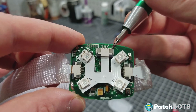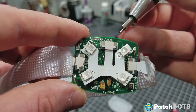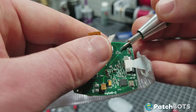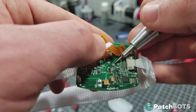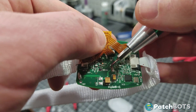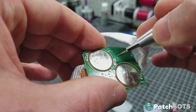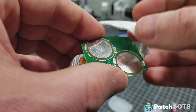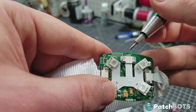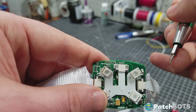Here's the main terminal for the NeoPixels. There are four pins labeled 1 through 4. If we trace off the fourth one, we can see it's a path on the PCB that travels down to R4, which is a resistor. After R4, it goes to a power source — the positive terminal of SKT4, which is the six volt terminal. So I know that there were six volts going into the NeoPixels. These other three pins are your R, G, and B for red, green, and blue of the NeoPixels. Mixing up those terminals is how you get all of your colors.